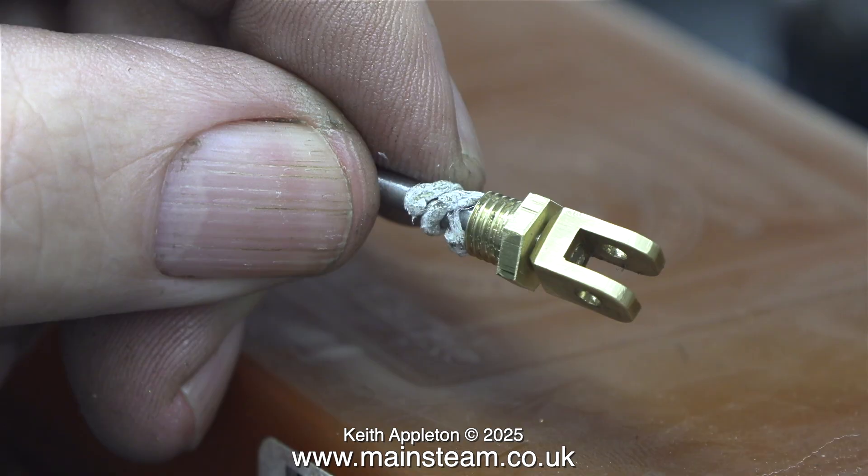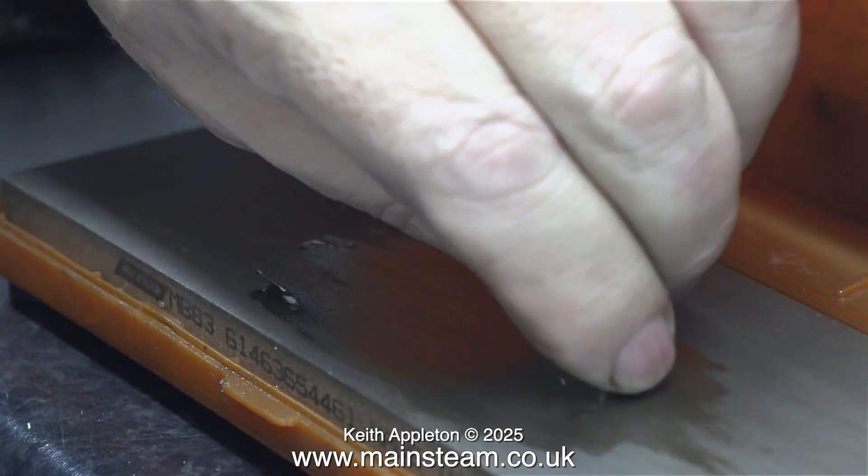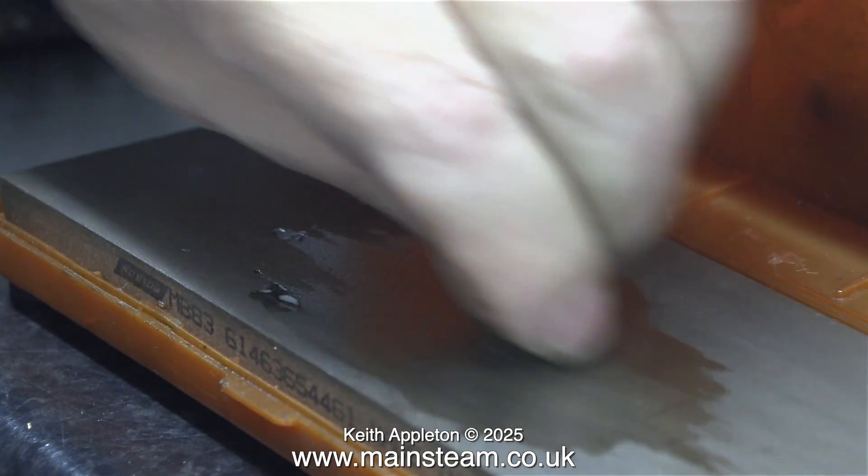This opening image shows the teflon coated yarn wrapped around the valve spindle. It's really important to make sure the slide valve has a very clean and even face, and this one didn't have that, so I'm giving it some whetstone treatment.